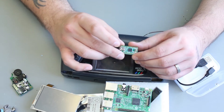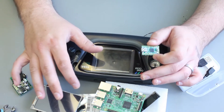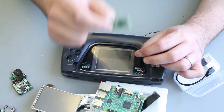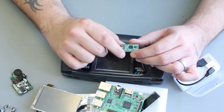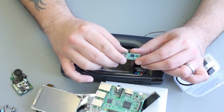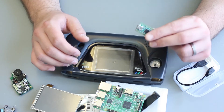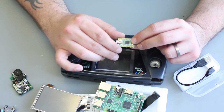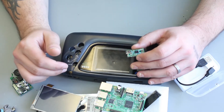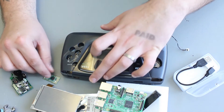We can build a platform where we don't need a specific Raspberry Pi in it. If something more powerful comes out, I've already pre-designed my buttons to be a USB device, which makes the whole thing more flexible. The other bonus is if the SD card gets corrupted and you lose your Raspberry Pi setup, you've not lost your button configuration because that's held in the firmware of the Teensy. This is a GPIO board that we'll configure as a joystick device in the USB controller, so any PC or the Pi will detect it as a joystick.